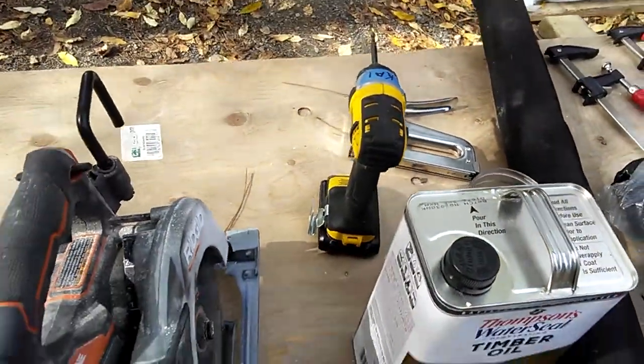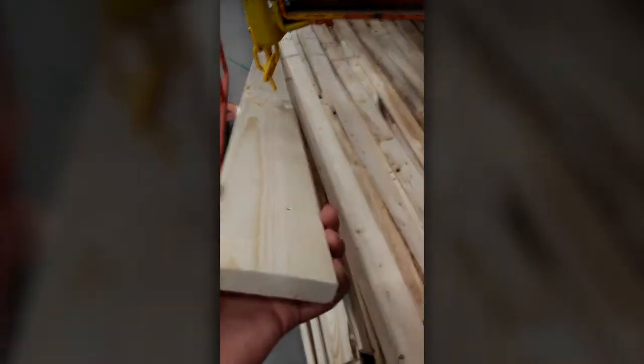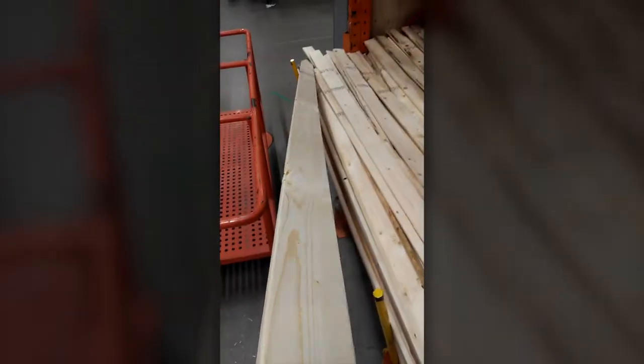I had all but the lumber in the farm shed, so I headed to Home Depot to buy the wood. I chose regular 1x4x8 lumber. A lot of designs online used cedar, which is a nicer looking wood and also water and rot resistant, but it's much more expensive. So I went with the regular lumber and decided to apply an exterior wood oil stain to give it more water resistance and longevity. When selecting your lumber, there's going to be a lot of variation — don't be afraid to get in there and select the nicest looking and straightest pieces you can. It will make things a lot easier to work with.